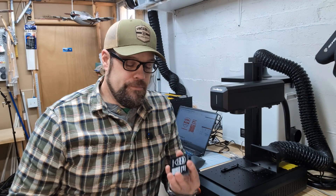Serializing business cards isn't necessarily a required thing, but this would be great if you're working on a series of items needing placards, or if you're a small business producing machines — these work with a variety of metals and you can add serial numbers. If you have a gantry style machine, this same process works for you in how you lay out items. Fiber lasers make quick work of these; each card was about 40 seconds, so 30 cards took about half an hour. Even saving 10 seconds per job over 30 cards adds up, so run those material tests and dial in your settings.